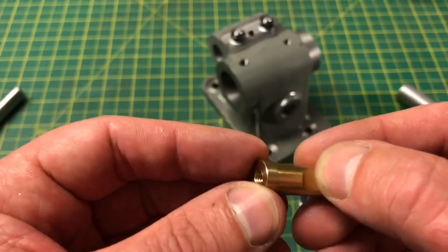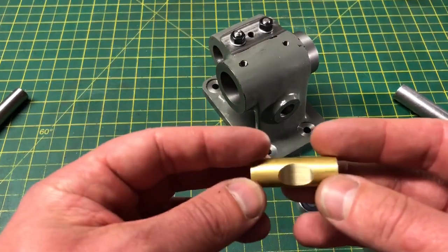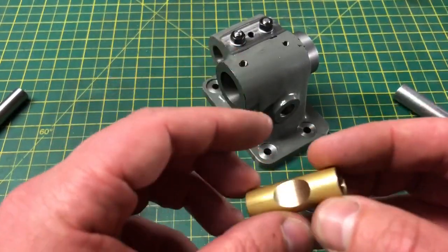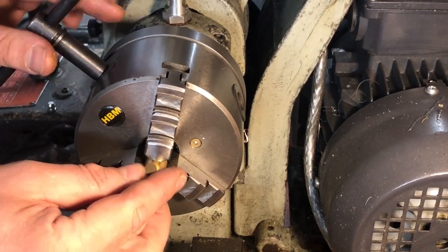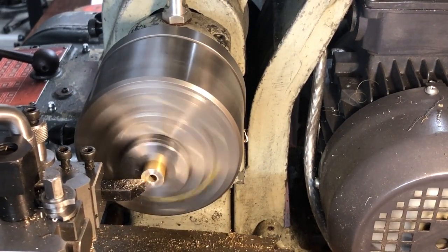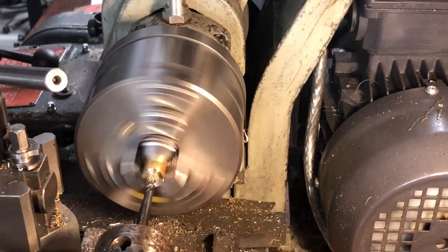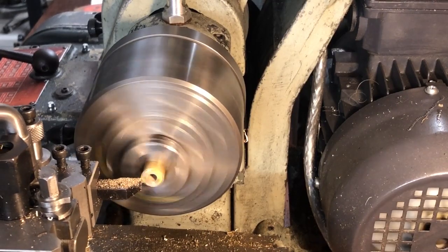Next up are the clamping cotters. I will need to do these ones for the tailstock block, and also this one for the main spindle. They have been machined in one piece, but they will need splitting with one half being tapped and the other side drilled clearance, so that tightening the bolts will squeeze them together. I have already cut these in half using a hacksaw, and they just need tidying up in the lathe. The first is faced and tapped, and the second is the same, only it's drilled clearance for the screw. I'm taking the time to add chamfers and countersink any holes while they're in the lathe, and the only thing of note here is to ensure that the correct half is tapped, as the components are not reversible.